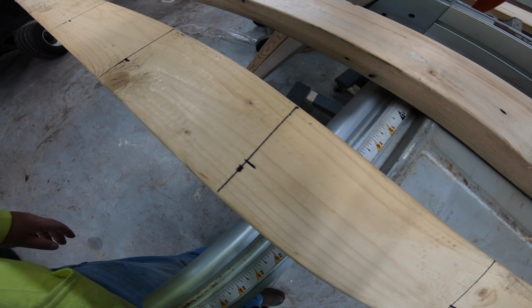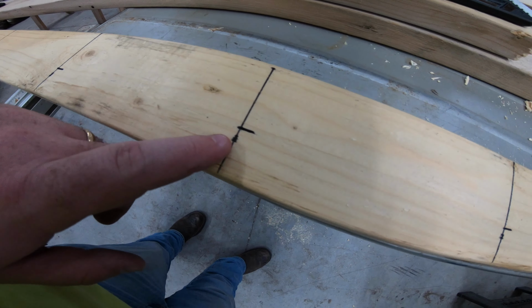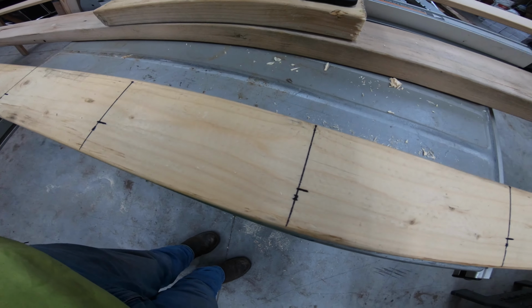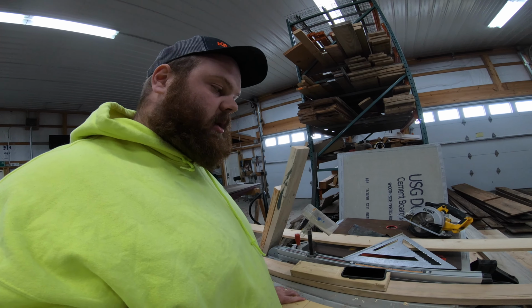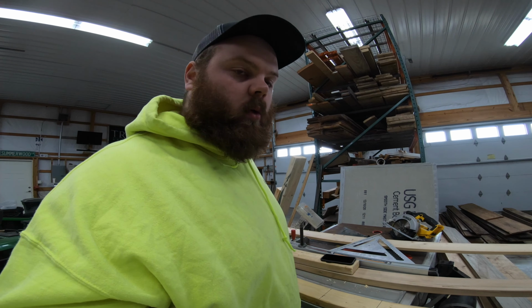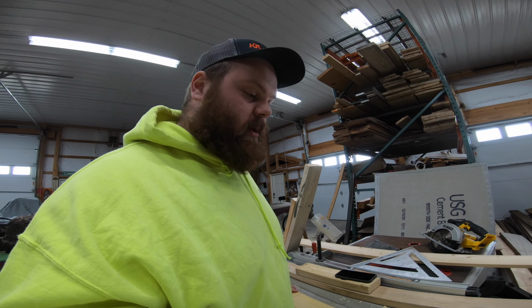It's really important to have a very nice square. It makes everything much easier. As you can see there, I've got my marks now. So what you're gonna need now is a big paddle bit on a drill. And then you're just gonna wanna drill out as far as you think is necessary. I'm probably gonna do between 1/4 inch and 1/2 inch, and that should be plenty deep and perfect for the end of the rod to sit in.